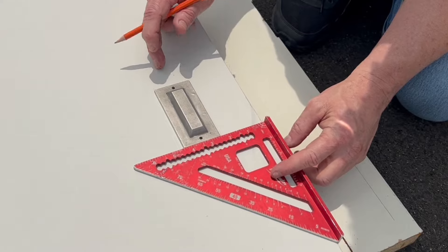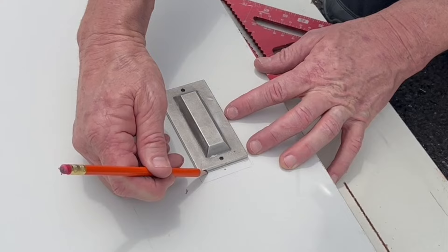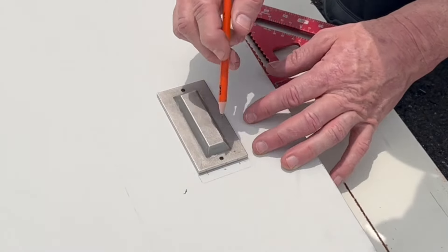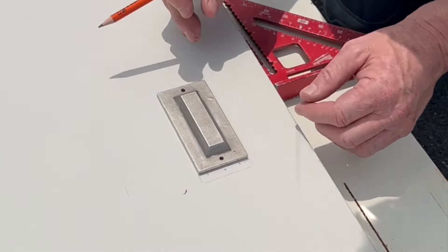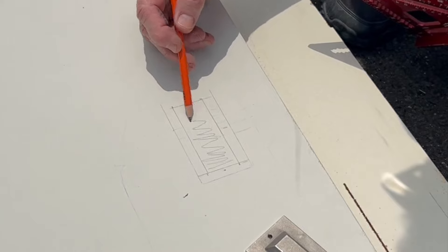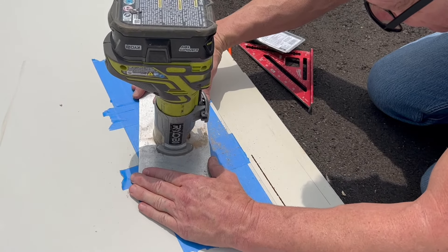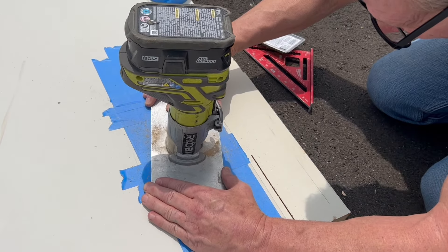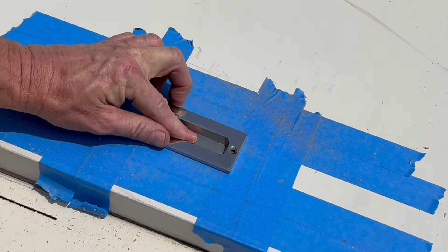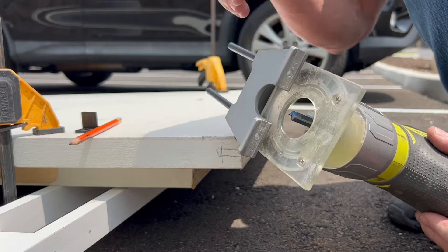We decided we want our pull right here, so I'm putting the edge at two and a half inches. I want to cut wider than this guide but not so wide that we make a hole. I like to put tape down because it'll protect the door against the base plate of my router, and it makes it a no-brainer — I know I can't cut into that blue tape. When you're cutting a bottom channel, put the fence on your router — do not try to do this freehand.